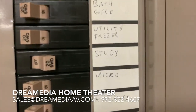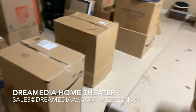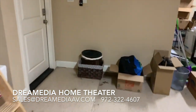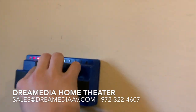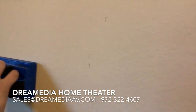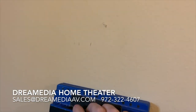This one actually was labeled properly, but in older homes that's not the case. So now our power is dead, and we can pull that outlet out without having to worry about getting shocked. Grayson's checking for studs right now. You can see we have a stud right there, which is right in the center of the room — you can see it marked out where the customer wants it, and then one way over here.